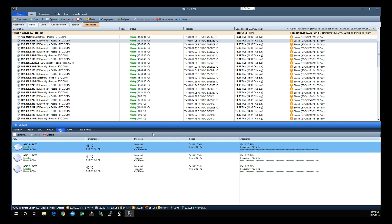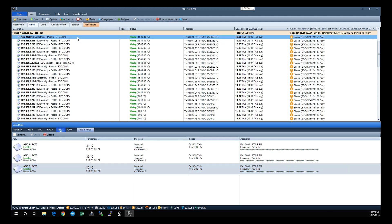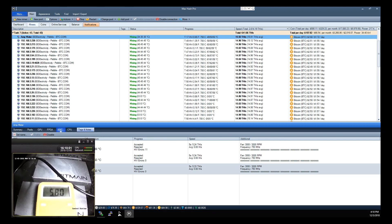You can see the hardware errors are pretty low and the chip temps are good. This is one that I actually pulled down — it's in a different tank, that's why there are 43 miners instead of 42 — but this one has the amp meter connected to it. So this one's running at 750 frequency and doing about 16 terahashes. You can see that it's running at 5.8 amps for roughly 16 terahashes.